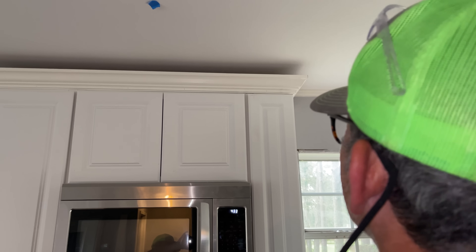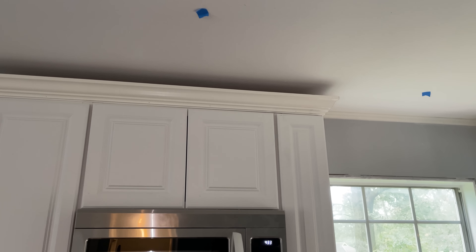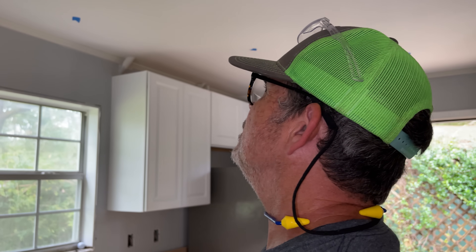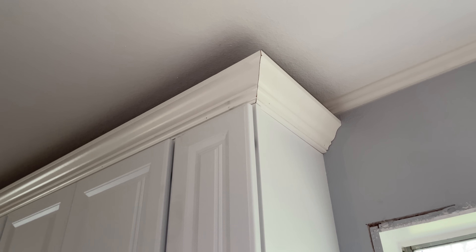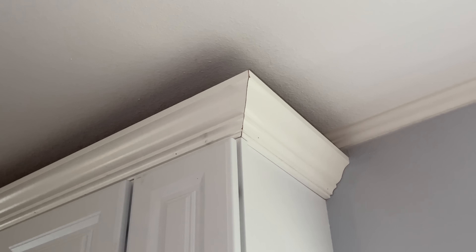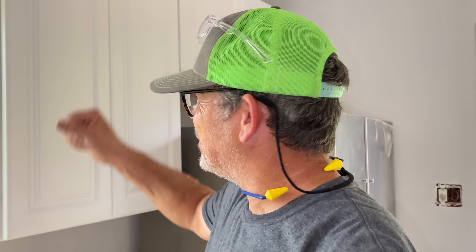I love that method. That is sweet. That does look really sick — that extra detail you get from the nailer. You would never know that that's a nailer — it's one more little step in the profile. Let's check this miter, see how that looks. They're a little fuzzy because it's MDF, but a little sanding, a little paint — that's going to be great. Look at that miter lining up with that face frame right there. Love it. Let's do this one.